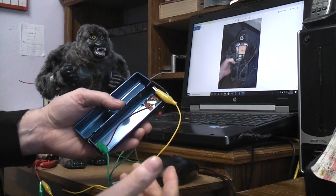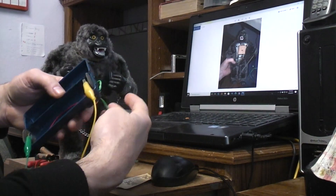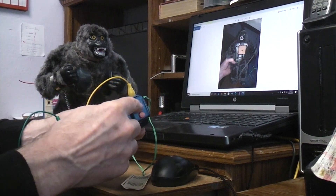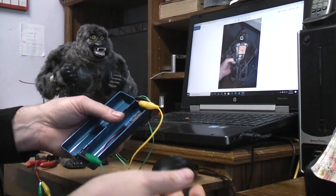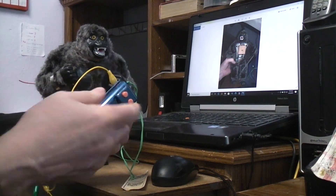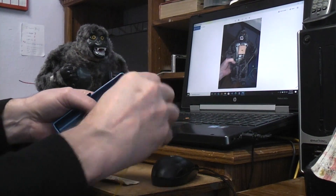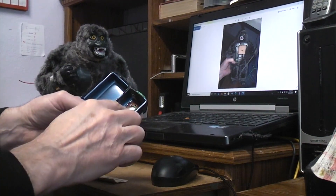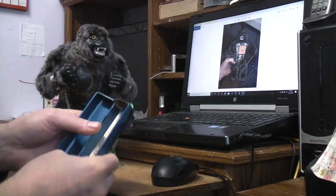I get my three volts there — good. Then I go to where the wires leaving the unit are soldered on, put my voltmeter across those two pins, and push the buttons. One way you should get plus three volts, push the other button on a two-button remote and you should get minus three volts — it should be able to reverse the polarity. If that's not working, you have to take your remote switch apart, clean and straighten the contacts to get that going.